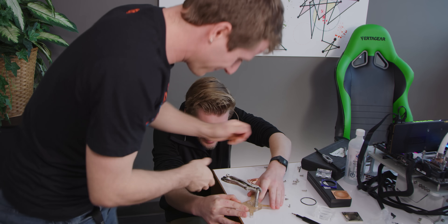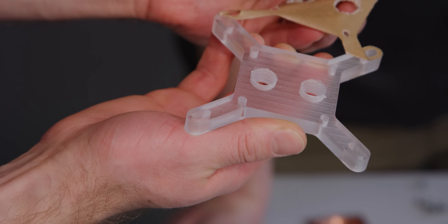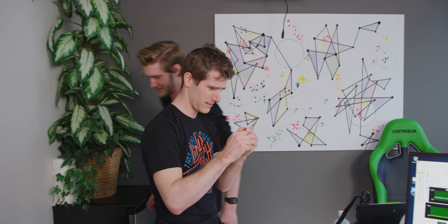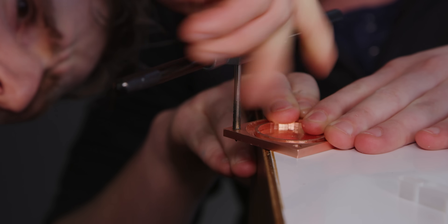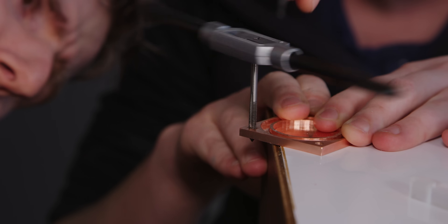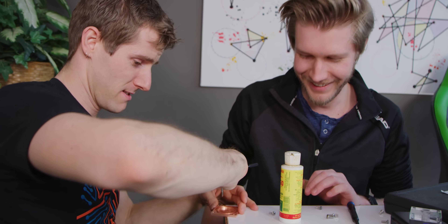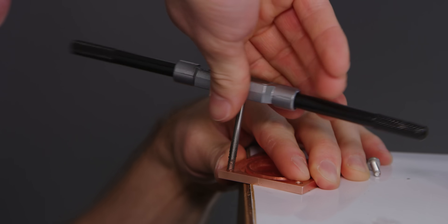Tom Petty was wrong — the starting is the hardest part. Oh yeah, this side's much worse but we can probably work with that. Just flip it over. We need some fluid — definitely, lubing it is a good idea. Every half turn or so you should go back and break the chip. That was a good idea lubing it — I take back what I said. Look at that, it's like a threaded hole and everything. Making this with an angle grinder would have been a much more interesting video. Times three more.